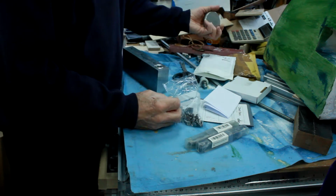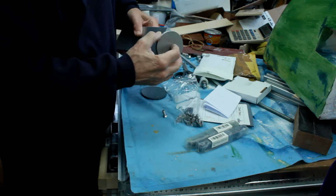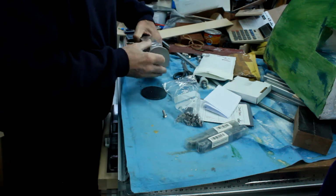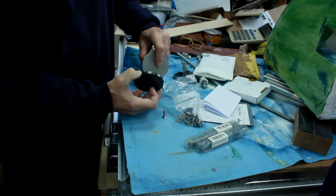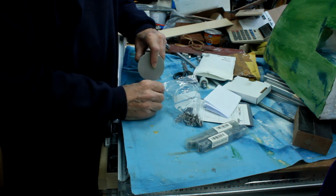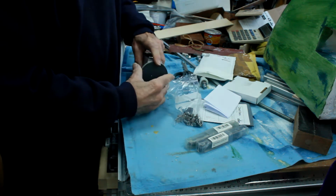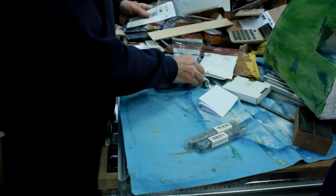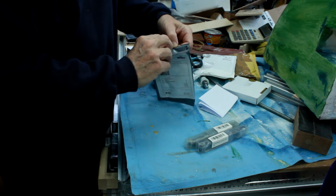These are going to be used in the front ends of the axle, where I've got to bolt that aluminium plate, which will be bolted to the kingpin holder. So that will be at the end of the axle, and that will be welded to the tubular front axle itself. And the intention is that once those two are fixed together, I can drill holes through. That will be countersunk, I think it's that way probably, countersunk, tapped and pushed through, and then it will bolt together on the front axle. So that's what those are for. So it looks like it's all front axle, front end stuff arriving now, which is what I've been concentrating on, because I think I've got the back pretty much sorted.